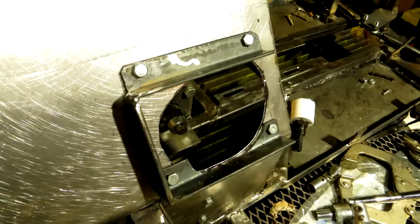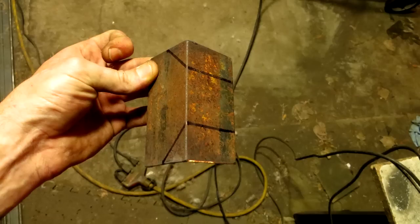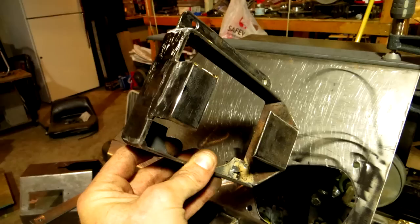both going in the same direction, going upwards on the machine. One of them is notched out so the filter can get through there. Now what I had to do next is build a piece, because my initial plan is to put some sheet metal over the top of that. But it needs to be angled, so the idea was to put together a front and back tab section. So I grabbed a piece of 2-inch angle iron, drew up the notches and the areas where I was going to cut it, got that done, and those cuts are at 45-degree angles.